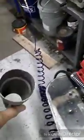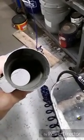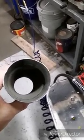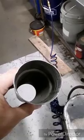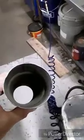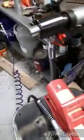While my compressor is filling up — I want to make it accurate, air for air. This is the original pipe. We're at about 160 pounds using direct air, because when I tried to do it with a regulator at around 130 it really didn't perform that well. So 160 psi direct air works pretty well on the 045.